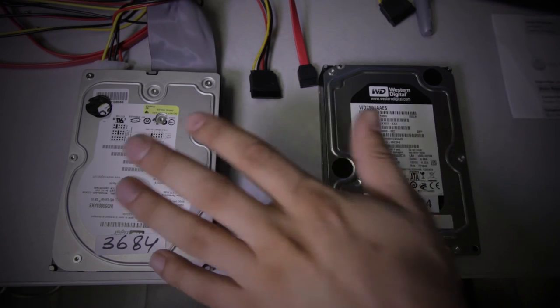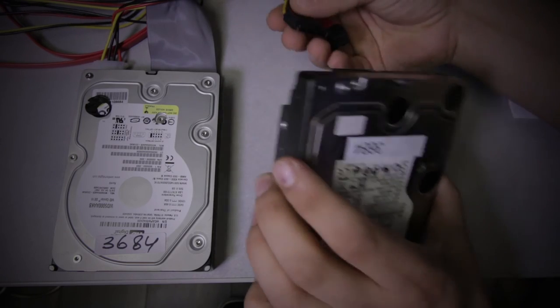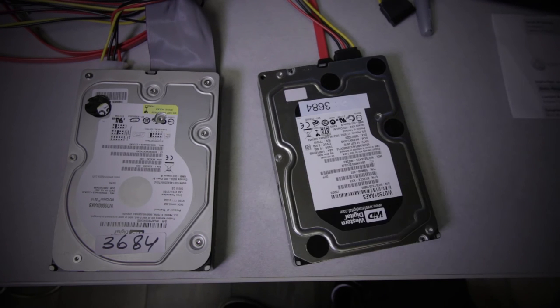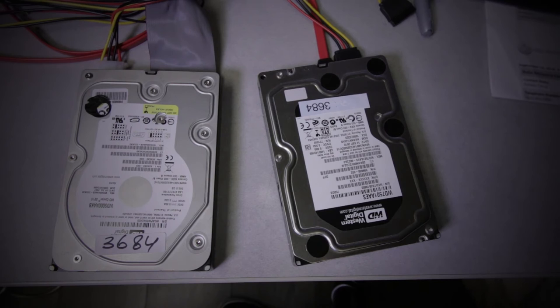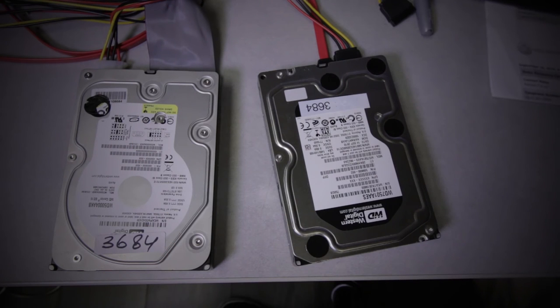But what we're gonna do now is power on this unit, and this 750 gigabyte drive is gonna be our target for the disk imaging process. I'm gonna attach this and just keep it off power for now. I'm gonna run my PC3000 utility and power on the parallel ATA zero channel. After about three tries, this drive spins down, but that's not bad news yet.